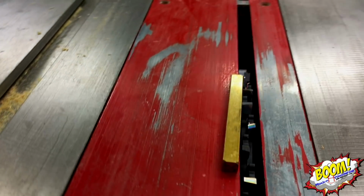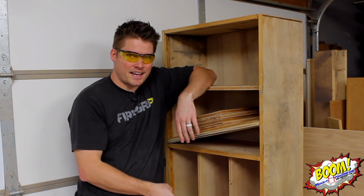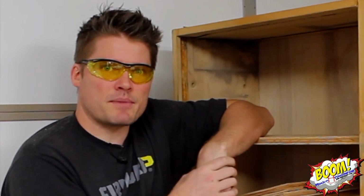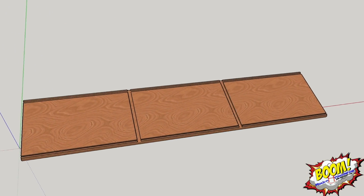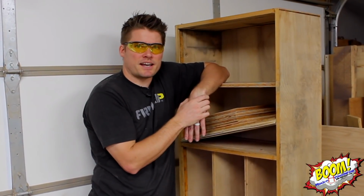The original cabinet, as you can see, had a center divider in one of the openings on the left and the right side of the cabinet. Now this is on its side, keep in mind. I'm going to omit this particular divider, and everything else is going to be adjustable shelving. The doors, however, were on sliding plastic tracks. Can't utilize those now because trying to salvage them out of this cabinet, they got damaged. So my original design anyway was going to have 1/4-inch dados along the top, bottom, dividers, everywhere. So no matter where the door slid, it was going to be accepted in an adjacent dado.